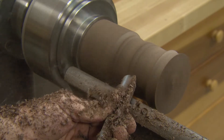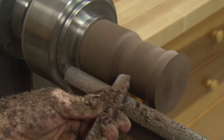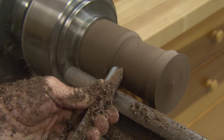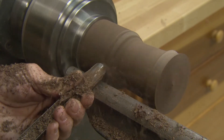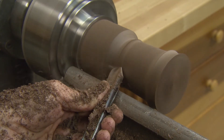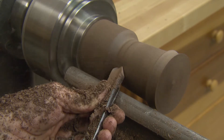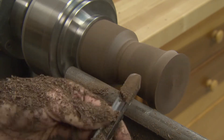The bell shape is kind of a curve inward from this point, then it starts to curve back outward. So we're going to just swing our body. There we go — we've got our shape going. We're going to clear this out a little bit because we're going to make like a bead shape over here. We've got to take out a bit of wood yet to get the shape we want. Now we're really close to the shape we need for our bell.